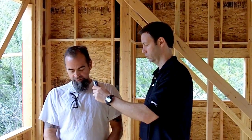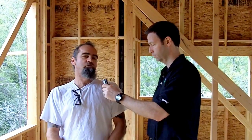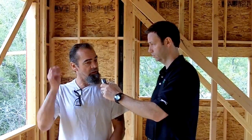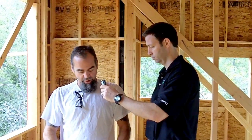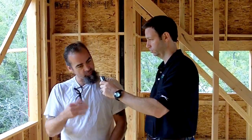We love these TimberStrands. They're great. They're dimensionally stable. They're super strong. We're able to use a smaller member in place of where, say, a 2x12 would go. They're so square and nice and much easier to handle. Cost savings for us also in terms of just cutting them to length instead of cutting two 2x12s and a piece of half-inch plywood, ripping it down as well, and then putting it together, making sure it's square and straight.